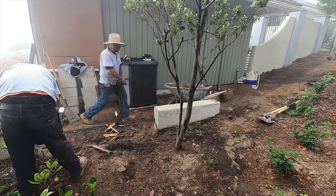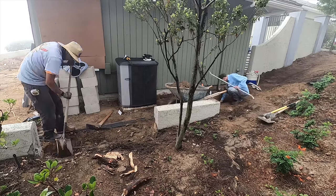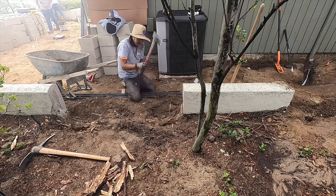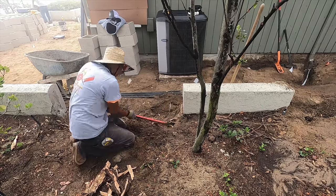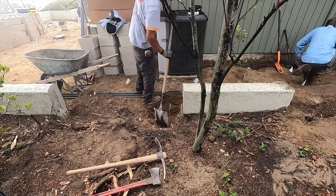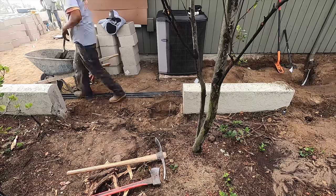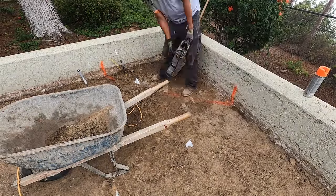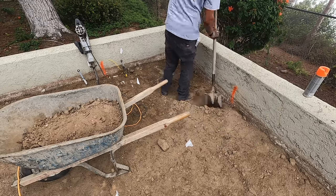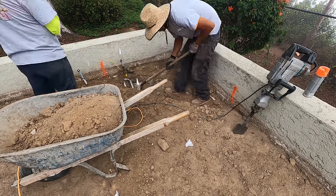Then on the other end, to the right of that existing wall, we're going to extend that out a few feet and then turn it back to the house. We're going to go up a little higher, a little more privacy, and then radius it down. So we'll show the entire build of the wall, the grouting, the steel reinforcement, the epoxy dowels going into the existing wall and footings. So you get an idea how to build these so that they'll hold up for a long time to come. And it's a special treat because we have some real master masons on this project.